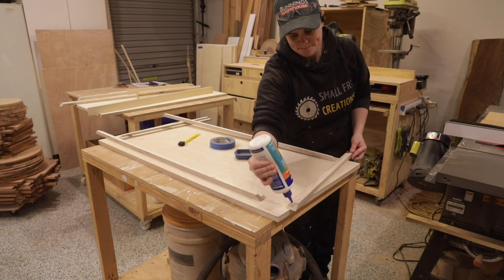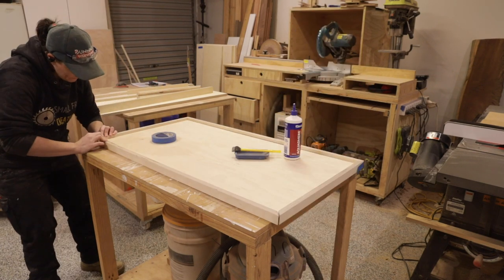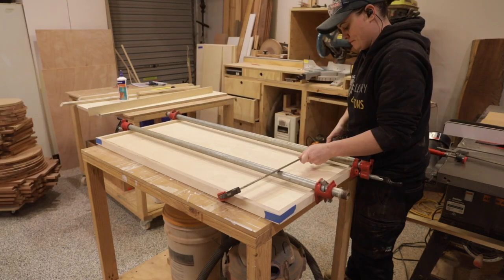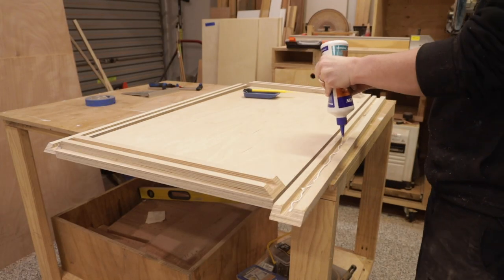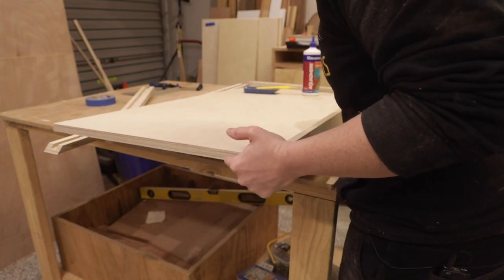With the pieces cut, I could get onto glue up. I used blue tape to hold everything together and then could come back through with clamps. I kept each frame in clamps for a couple of hours and then could move on to the next glue up. The glue ups were mostly stress-free, with the dados and the rabbets making it easy as the photo panels help keep everything square and together.